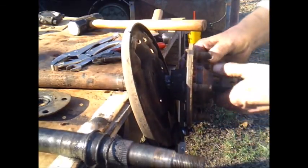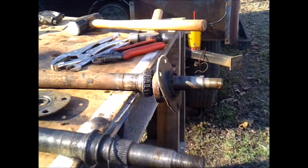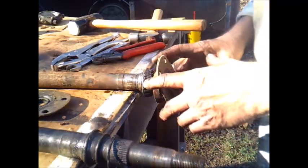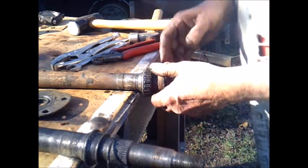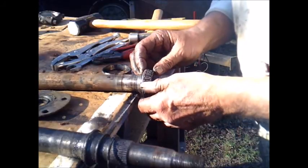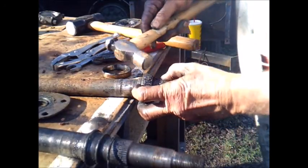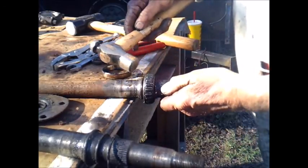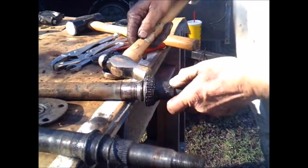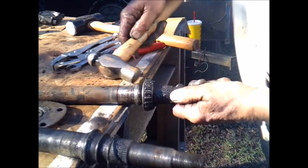Now this one's off the left side. I have for years had a problem with this side and hadn't had nerve enough to fix it. The old bearing's good, but see how that bearing wallows around on that shaft. What we're going to do is get it cleaned up, and I'm going to take a welder and build that up. Then tomorrow we're going to see if we can get the old lathe started and turn that back down so that bearing ain't wallowing around in there anymore.